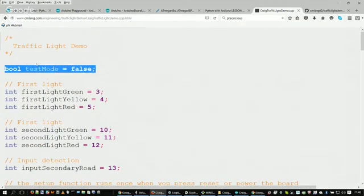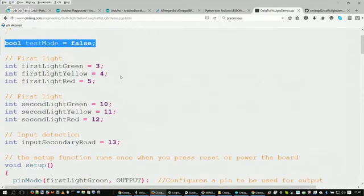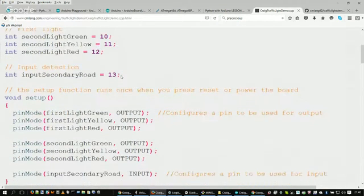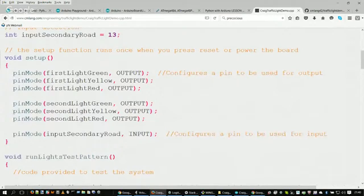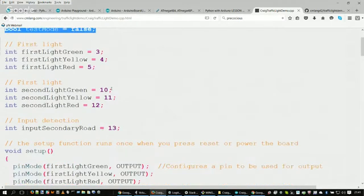So you can see here that I'm doing one of the things that people say is an absolute no-no, creating global variables. In the world of Arduino programming, you don't really have the niceties of structure of full C or C++, where you want to program defensively. A lot of people say, "Globals are bad." But when you're dealing with 40, 50 lines of code, really tight functions, and everything's pretty much procedural, you don't have to worry a whole lot about global variables. In fact, global variables will save you time having to type things over and over again, and memory as well.